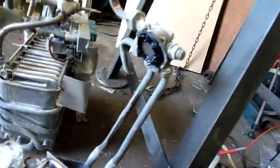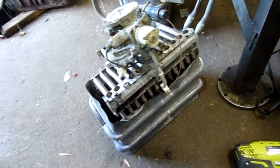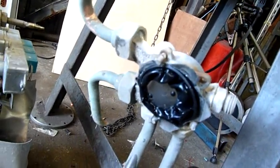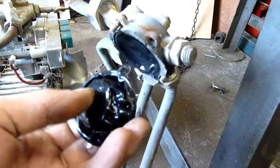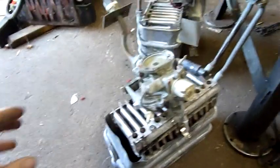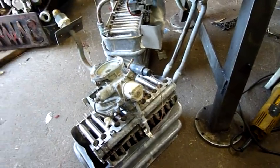Since I've decided to take the valve body apart for the brass base — this is the 1984 oddball one, the black one, can't remember what it's actually called. You can see that diaphragm — it's completely blown out. So there would have been water getting into the gas valve assembly, and it probably would have neutralized pressure, bled out through the side of the valve block.